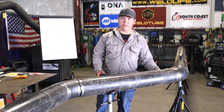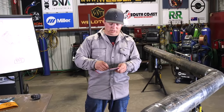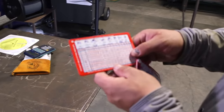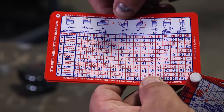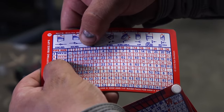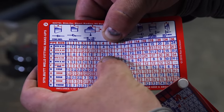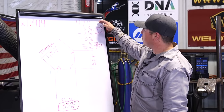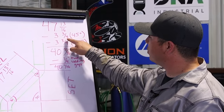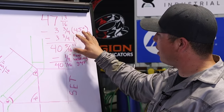It's actually going to be two 45s that we will be removing to get our distance of pipe. To figure that out we refer back to our Chico cards, going to page 7a. We are going to use section C, which shows the 45-degree elbow — going down to the letter C and across to 6-inch pipe, and that gives us a takeoff of 3 and 3/4 inches. So we have two 45s, each with a takeoff of 3 and 3/4 inches that we need to remove.